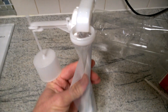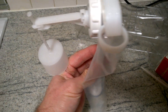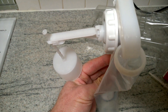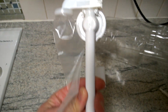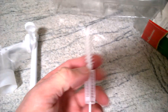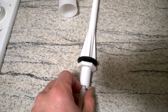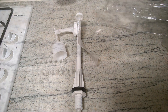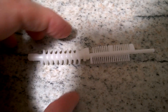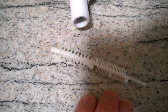So that is it built. I want the float to come in with the water supply incoming facing me, and the float's going to be to the left — there should be plenty of room for that. So that's on the top and then of course remember to put that in as well — shove that in the bottom. I just wanted to double check everything, so that's it built. By the way, these don't click together, they just have a press fit — the jaws just press together — so it allows you to pull it out but it's easy to remove.